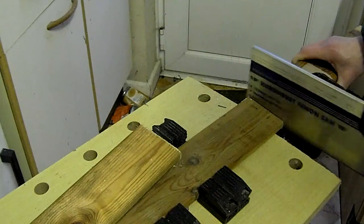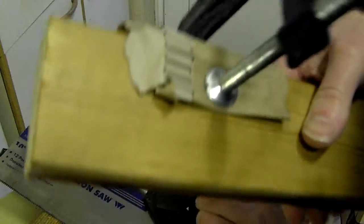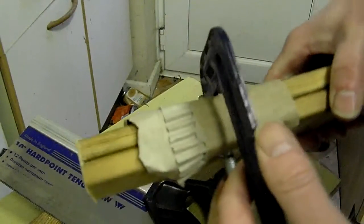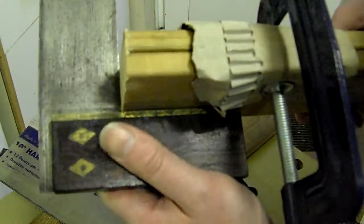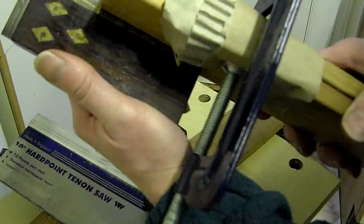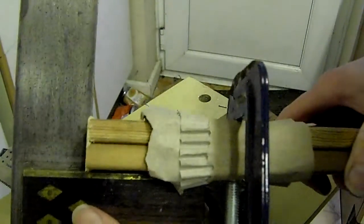Being very gentle towards the end there because we don't want loads of splintering. I know I'm only doing this rough old bit, but if you can see there, I've got a nice result — both edges line up. You can see they're both lined up and it's a nice square. If I put a square to that — see how that's nice and square? We haven't got any gaps there. That's a nice, square bit of sawing done properly.